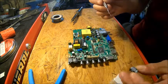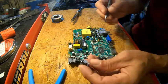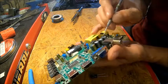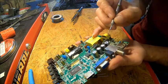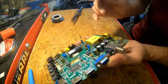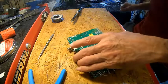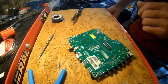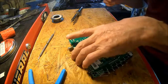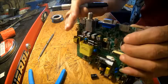What you have to remember on these capacitors is you have a negative side, which is this silver strip. These have to be put in the right direction. If you notice on these, you have the white strip right here on this side and both of them are on this side — all of them are facing in one direction. So we have to have that silver stripe on the correct side. The first thing we need to do is mark which ones they are, so let me get a marker. We want to find those on the other side, which is right behind this piece right here.